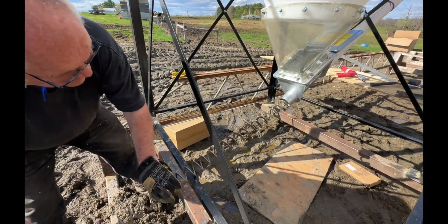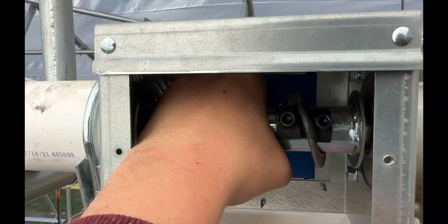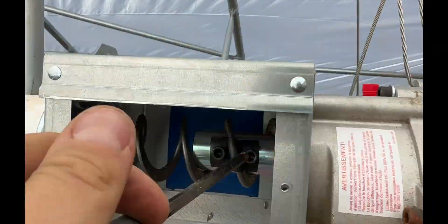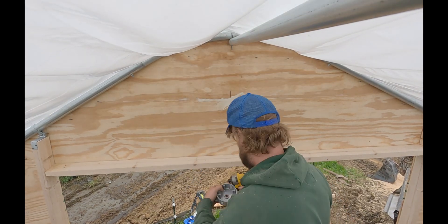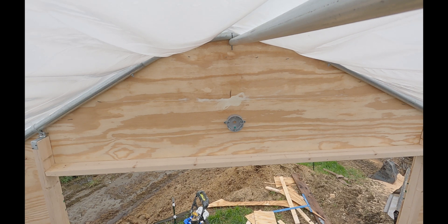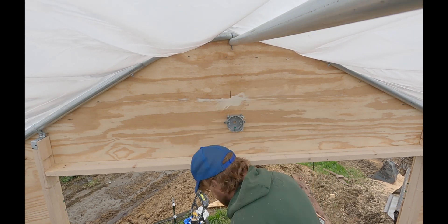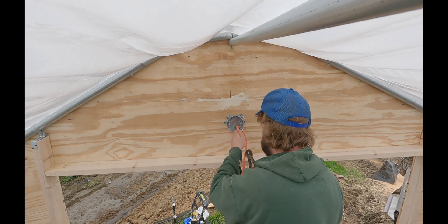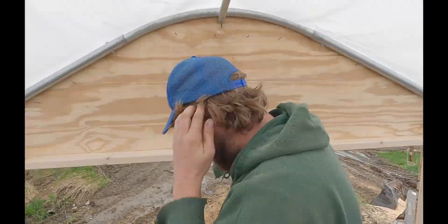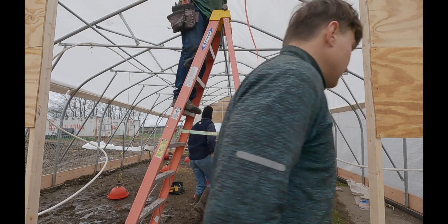Now we're going to push the flex auger from the grain bin all the way until it gets to the motor and attach it with the supplied hardware. I'm going to skip over the rest of that installation because Hog Slat has a really good installation video — I'll post that in the description. Next, I'm going to install the junction boxes and outlets for the motor and grain bin system. I install a three-way junction box on top of the interior of the chicken house, directly behind the motor, using 10-3 Romex wire, with one strand going from the motor to the junction box and then two going on either end of the house to electrical boxes.